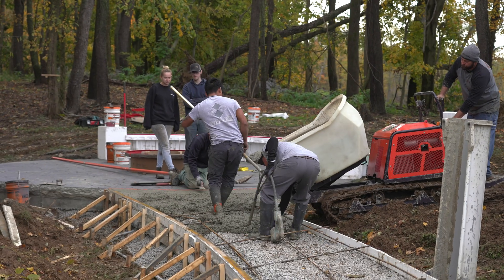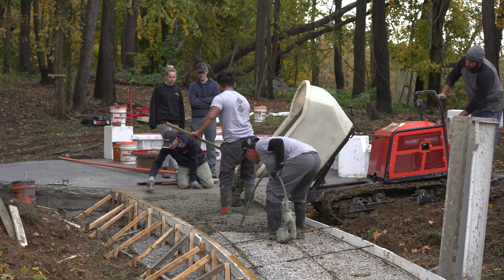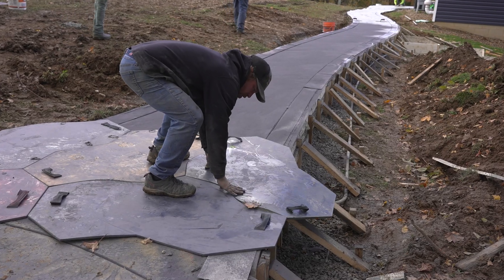What's happening is, after we dump that concrete out on the ground, in order to avoid those little cracks, we need to stamp that concrete before that crust starts to form. In spring and fall conditions — cold at night, warm during the day — it's going to be really, really hard to avoid this without adding something to your concrete.